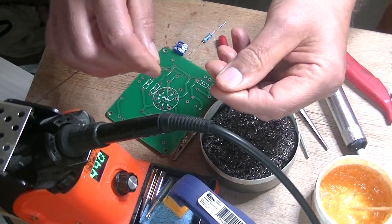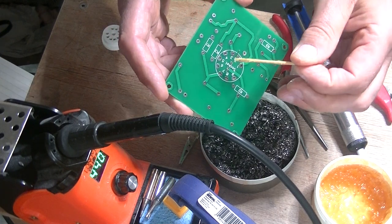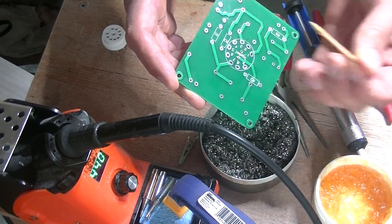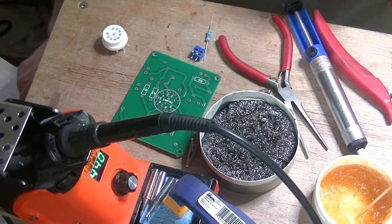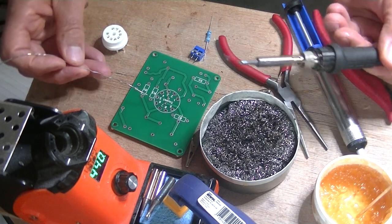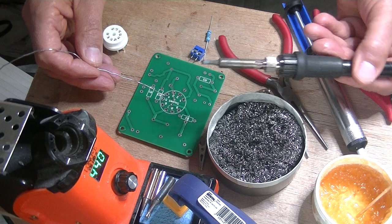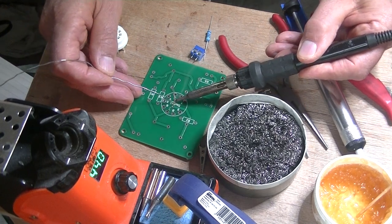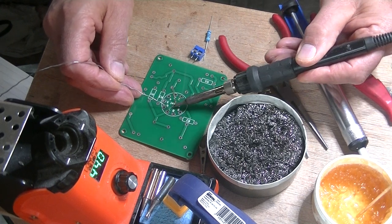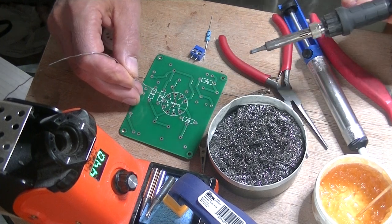We've got rosin core in our solder and that'll help it flow and help with adhesion, but often that's not quite enough. So I like to put a little tiny dab of solder flux or solder paste — this is no-clean. Just the tiniest little drop using a toothpick; you don't need much. You don't have to clean it up afterwards but it leaves a sticky mess, so you really don't want too much. Drop a solder on the tip of the iron. I'm going to come in on the tip of the wedge — this is a big iron, you could put a smaller tip on, but I just learned how to solder with just the leading edge of the wedge. Come in hard, bring your solder in, test — it's flowing — let it flow out, fill, hold for a second, let go. Do the next one: test, as soon as it starts flowing, fill, hold for a second, let go. Clean your tip.